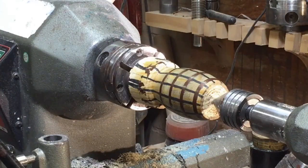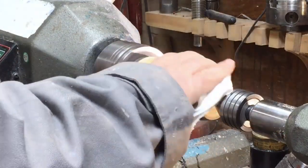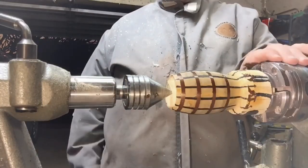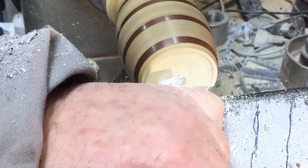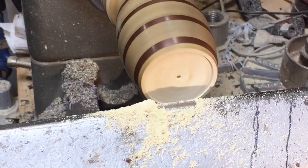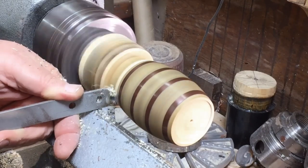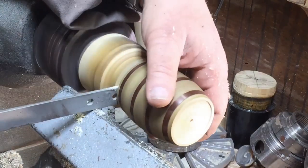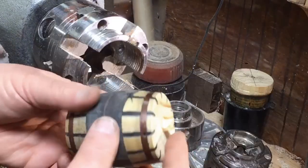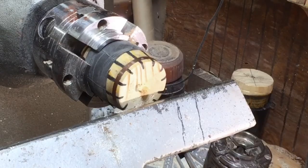I'm using Yorkshire Grit and then OB Shine Juice. I use sandpaper from 120 to 400 only. You can already see how much the copper shines. A wine barrel has an indentation in the middle where the cap sits a little bit below the line — I'm trying to replicate that. Now I'm going to part it using the black line parting tool — fell in love with it, it works on pine like butter. Before turning it around on the lathe, I'm putting a piece of bicycle tube over it so the chuck doesn't scratch it.